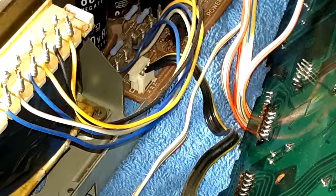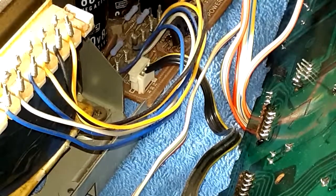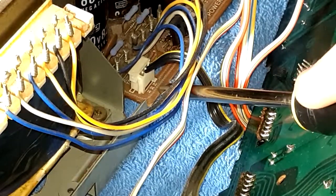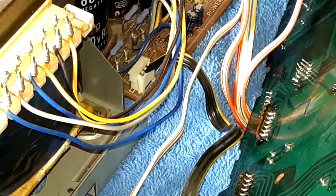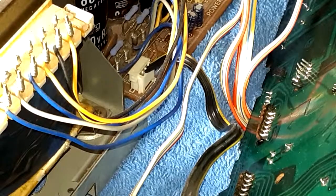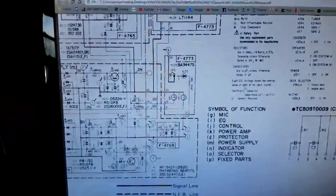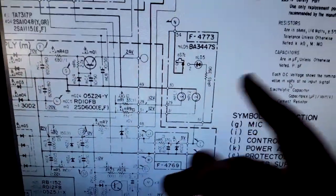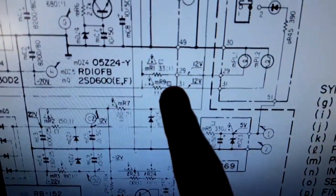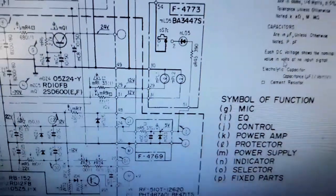More on this rubbish schematic: I ohm-tested both bulbs and I think the bulbs are actually the 35-ish ohm load. The connector on our main board is numbered wire 29, 30, and 31. So I'm rummaging the schematic trying to find wires 29, 30, and 31 and see if it links with a resistor or a transistor — like a little driver somewhere. It's just two bulbs but the whole front is dead because neither of them work.